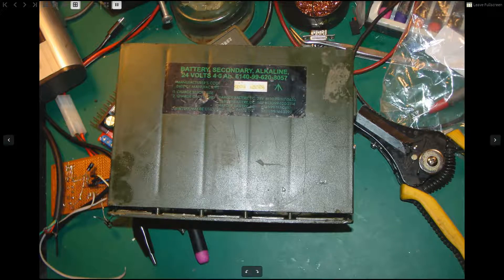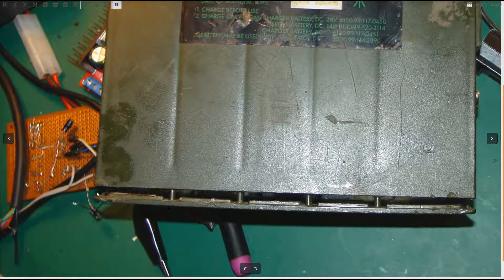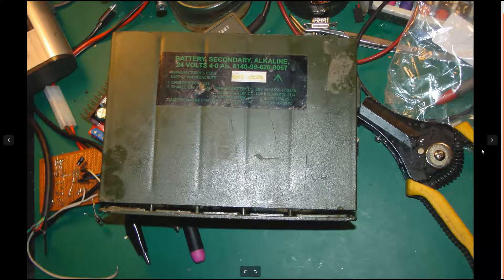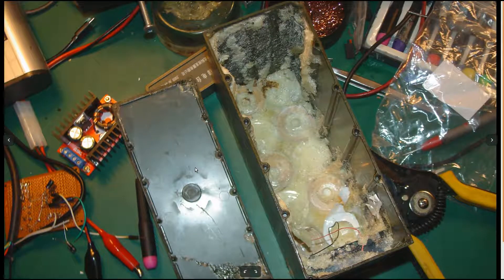The second problem with the newer battery is that the opening is on the bottom, and the only connected piece is a small element of plastic — you have to put glue over here to connect it. The seam is very small, and if you stuff things inside the battery it will be forcing downward on the plastic case. Another issue: when you remove all your cells and try to put different smaller ones, it starts to bend because it doesn't have support from the cells. You can feel that this plastic is not as rugged as you'd like.